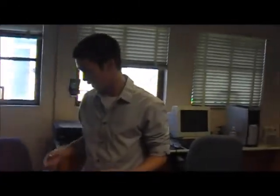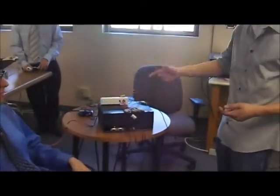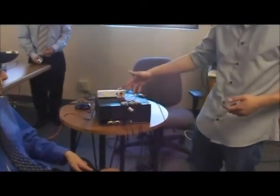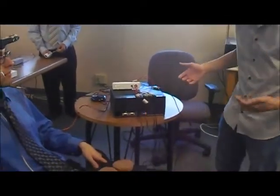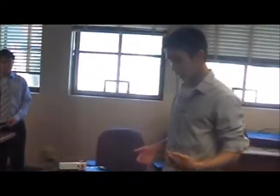We're the Wii V Fit group, and our project was to adapt the Wii so that a person with quadriplegia will be able to play the Wii. We have adaptive buttons which we connect to 3mm jacks here, and it's just like an audio jack, so any kind of switch or sensor that has that kind of interface you can plug in.